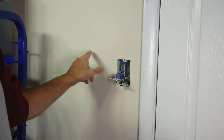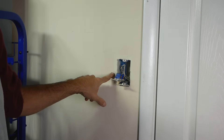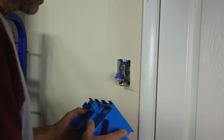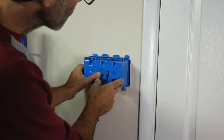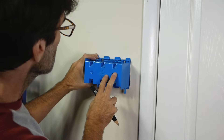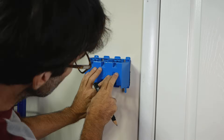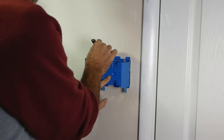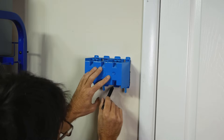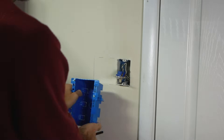When you do this, make sure that you go in the direction against the studs. If you cut this out and you've got a stud right here on this side, you're going to be upset. In this case, the studs are here by the door, so we're clear on that side. I usually put these backwards against the wall, tracing one side against the existing hole, so I can get the exact size traced out. Try to make sure it's on there straight — a little 12-inch level would be ideal.